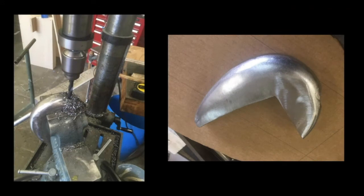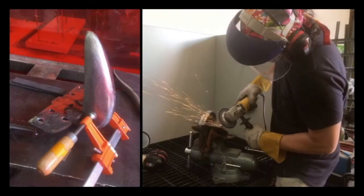Here we can see the hole being drilled for bolting onto the base plate, and to the right the arm in its finished shape. Note that you can't see Yutong's weld. Phenomenal craftspersonship. I didn't want to rely just on the one bolt, so we connected flanges to the sides in order to increase the amount of fasteners.